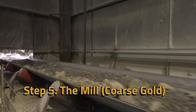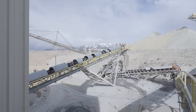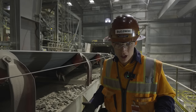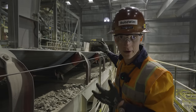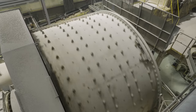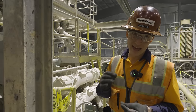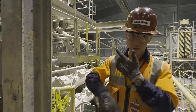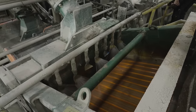We have to break the rock up to grab the gold from it. This conveyor is feeding material from the stockpile into a ball mill — like a giant washing machine, because it's wet. They feed the material in, there are steel balls inside that bang around and grind the material down, mixing it with water, turning big pieces of rock into essentially beach sand. The next step is sizing: that ball mill pounds everything but doesn't reduce everything to the fine grain size needed. Different screens filter the material — anything that can't fit through is recycled back into the ball mill, and anything that can goes on to the rest of the process.